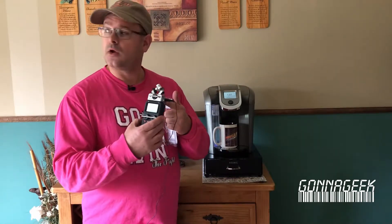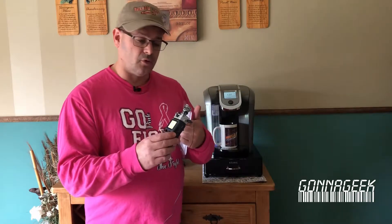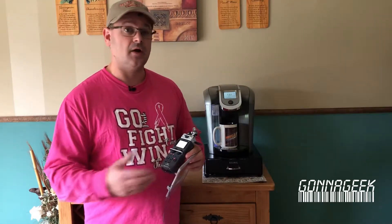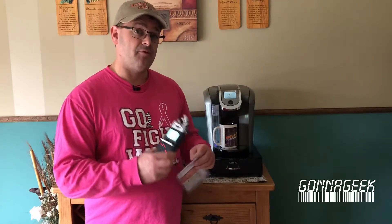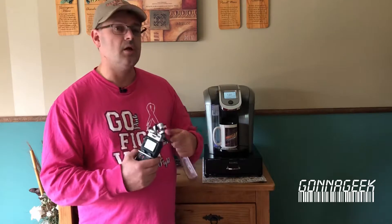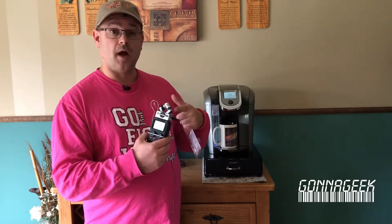You can see that the lavalier microphone is going into the insert right there, and it requires 2.5 volt power in order to actually record anything. So I had to go into the menu, go into in-out, and then turn on the power option for the 2.5 volt power. Now, it also can enable phantom power to the XLR ports down below, which you can turn on as well. But this is a singular lavalier microphone going into the Zoom H5 XY microphone capsule, recording the audio there.